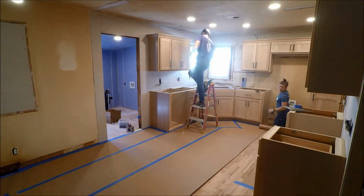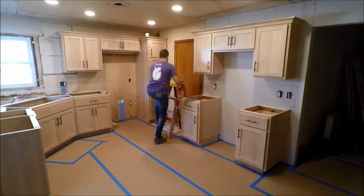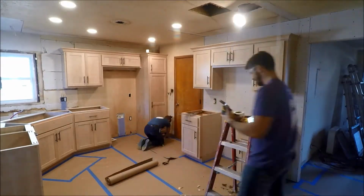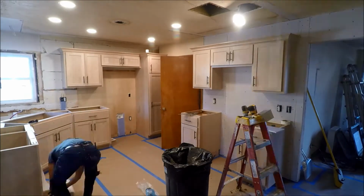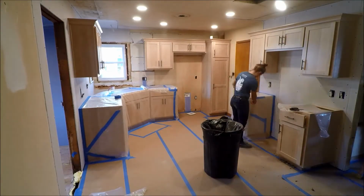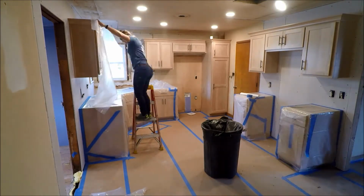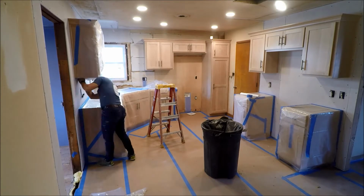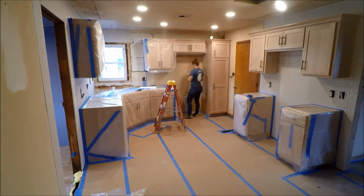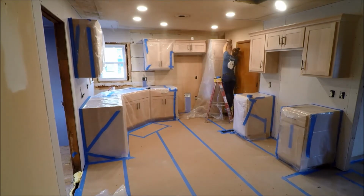And there you saw John adding, here I'm taping floors, but John is actually taping across the joints of our drywall. Yes, we're using a sticky fiberglass joint tape, which has its pros and its cons. One of the pros is it's kind of user-friendly for DIY people. You peel it off a roll just like tape and you stick it on the seams between your drywall meets, and it's there, it's happy.